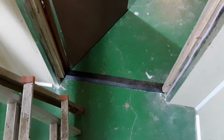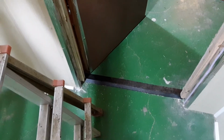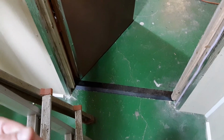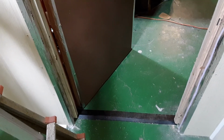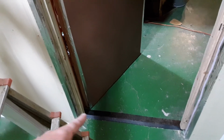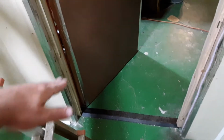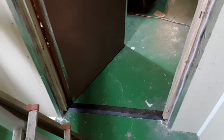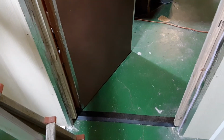I've got a little threshold down here that whenever I close it, it butts up real good on there. That's a 1/2 inch tall, and it slopes coming this way. Anyway, I floated the door 3/8 of an inch with something I had laying around, just to float it up in the air a little bit, so that way when the door does close. And when I built the door, I built it with that in mind, of using that, because I already had this. And so my bottom part of the door actually slopes downward on the far side, and slopes up on this side. So whenever it closes, it actually mates in with that pretty dang good. So I'm not really going to put any other kind of seal or anything like that, at least right now on there.